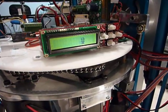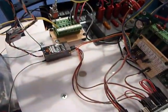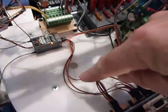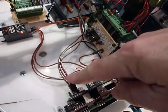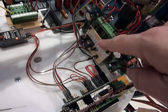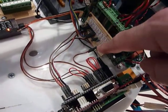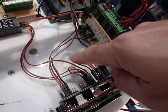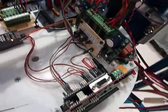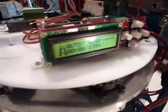So the way this starts up — the big difference is now, before I was in direct RC control, now the RC signals come to the controller and are processed. The controller controls the servo for the two legs, the two outer legs, and the center leg. It also reads the position of the outer legs through this analog input here, so it can control the leg much better.